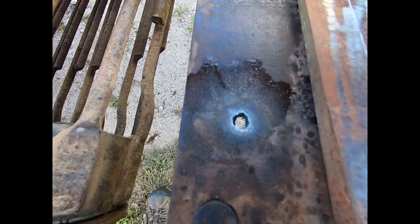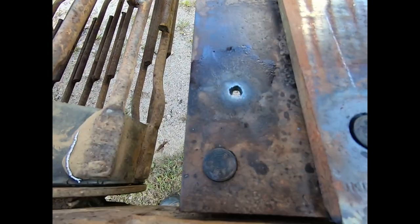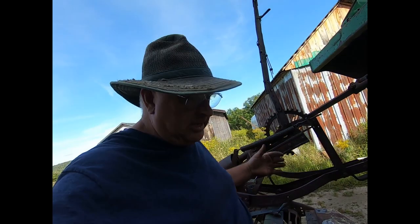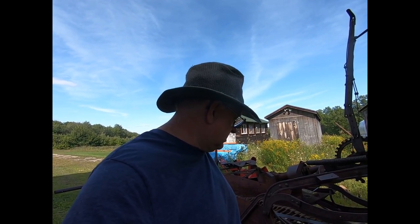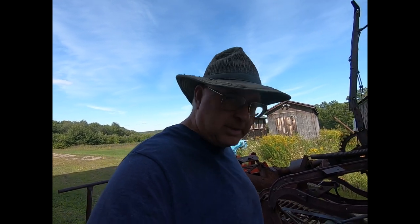As you can see, I did something I hate to do — I blew these out with a torch. This plate here was very difficult, very hard. This one you can't touch with a drill. I've never tried to drill anything that hard before. If I'd had a carbide drill I could have done it, but regular conventional stuff wouldn't go through it. It's obvious it was punched and then probably chilled — somehow they hardened it. So anyway, I'm going to do a little grinding off camera and we'll bolt that assembly together.